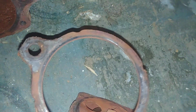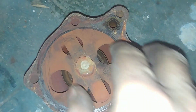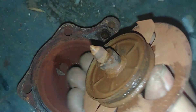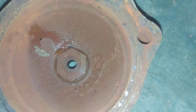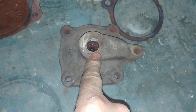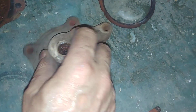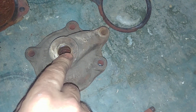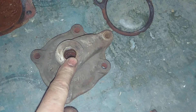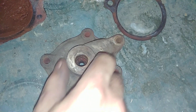This is the top portion. There's your gasket, and this is the thermostatic element. There is the exit point there, which is actually at the top. In the older style, pre-World War II, this vents out with a half-inch outlet, which then goes to the dry return and exits through the vent near the boiler.